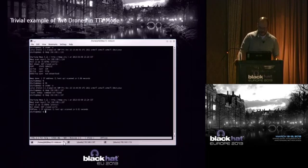So here's an example. I hope that you can see. Here's what I did. I logged into a system and I just ran a uname -a, and you can see it says drone 1 is the machine name. And I just ran a simple command. What did I run? nmap. Yeah, I just ran nmap on its local address or a remote address. And what you don't really see here, you just see OK. You didn't see that I typed in plus, plus, plus, waited, and entered all those commands because they weren't echoed back. And then I ran another command here, and notice that when I ran a uname -a, it said that one was drone 3. Right? So it's pretty simple. You don't have to program anything.